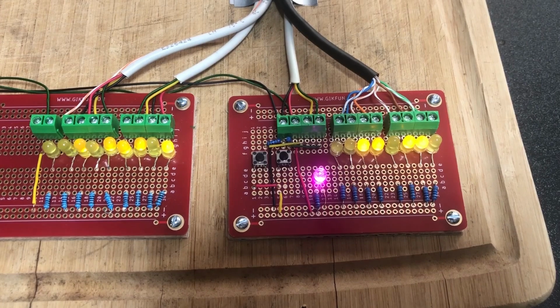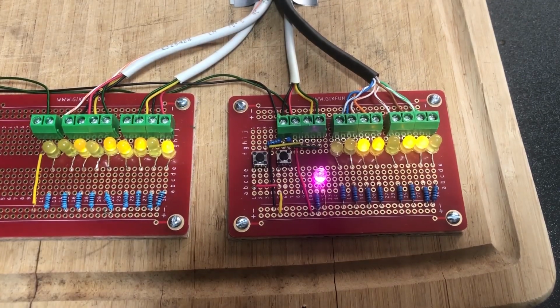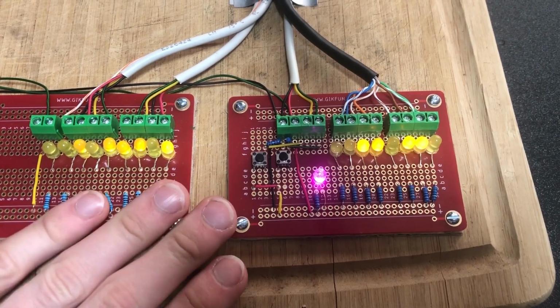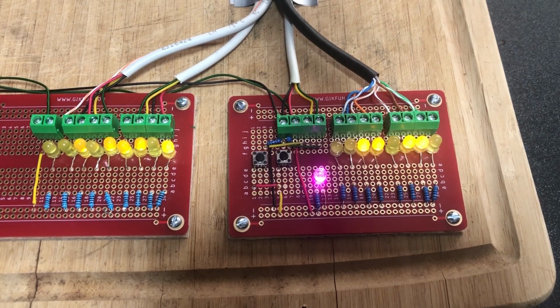So what do I got next after this? Well, this isn't the end of the 74LS calculator series. This is the end of the part where I work on this whole calculator. See, after this I have plans to make something a bit more advanced. I kind of want to make a CPU architecture based on 74LS chips, based on this sort of design. It'll be centered around the idea that you can throw two numbers in and it goes through a full adder, like what's up there, but then you could also tell it to go through other Boolean logic units. Basically, it'll be a big logic unit.